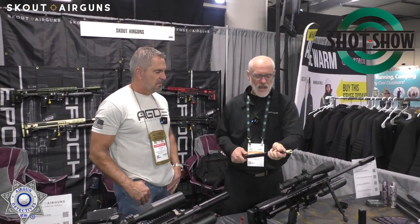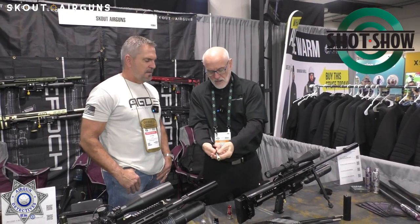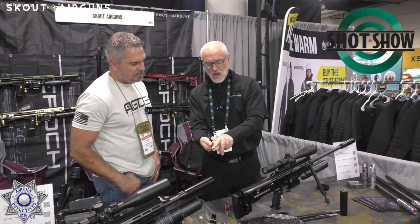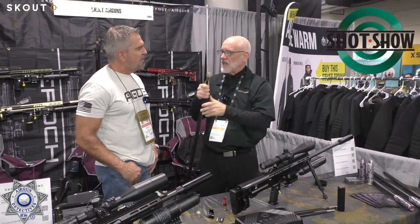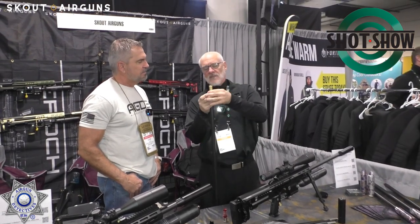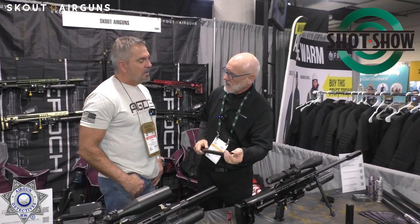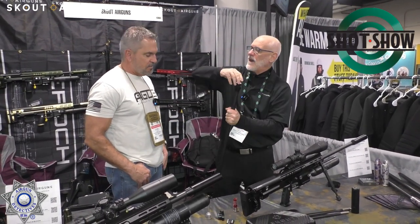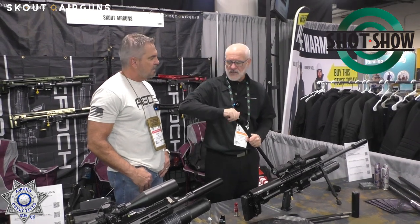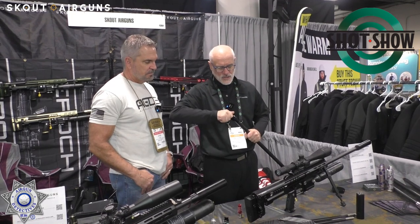Yep. So here's your liner, and the O-rings are very tight on this cap. There's a mark on this cap, which you can't see with the camera. I turn that nut a quarter turn. I just indexed a quarter turn. Now the barrel will actually follow the threads back in, so it will maintain that index. You could set the barrel wherever you want, index it, shoot it, experiment with it, and find out where you like it.